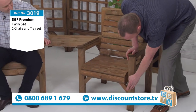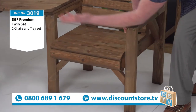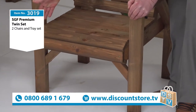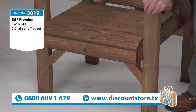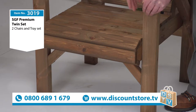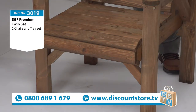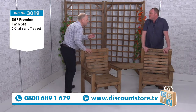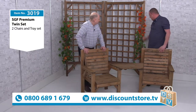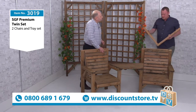With the construction — this is a major thing to look out for when you're ever buying furniture. If you come down here you'll be able to see our brace bars. It's a 45-degree brace and they're on both sides of the chair. Not everybody has them — you do see some out there, but we pride ourselves on this because it's all about durability and strength. You want it to last. I'm a bit of a big chap and I can give it a good old rock — that's not going anywhere, and it's those braces that make the difference. To prove the point, I've brought in one with no braces on.